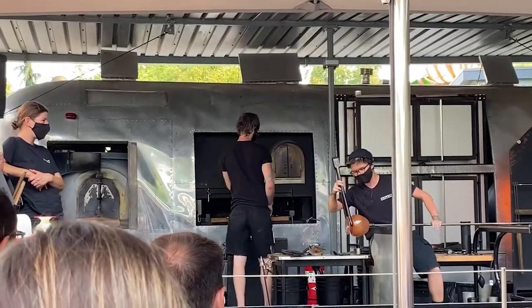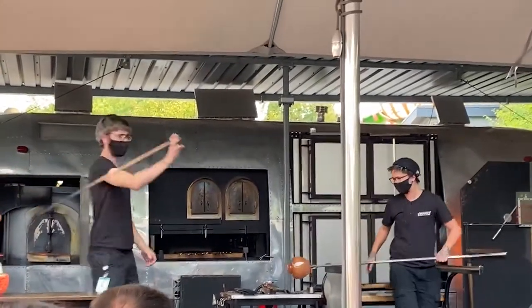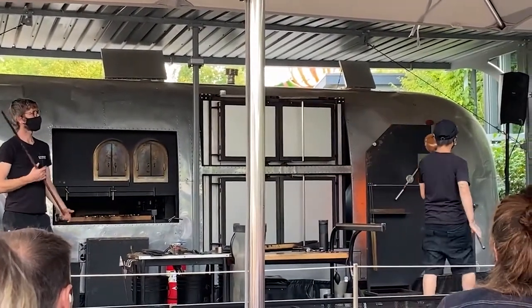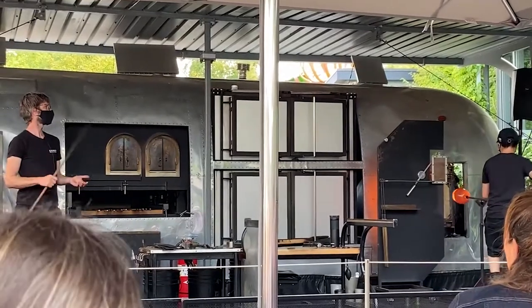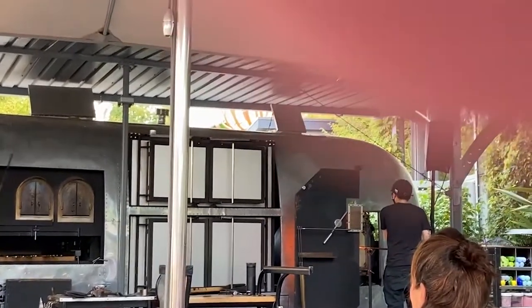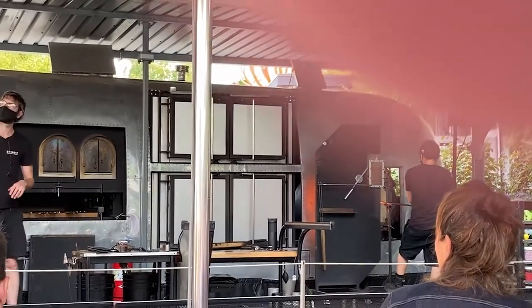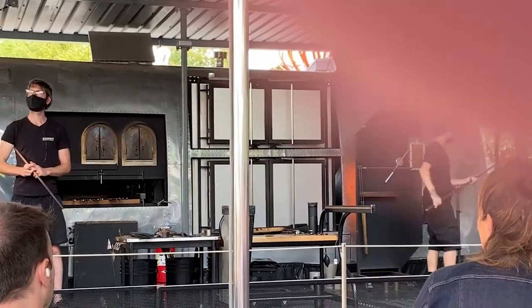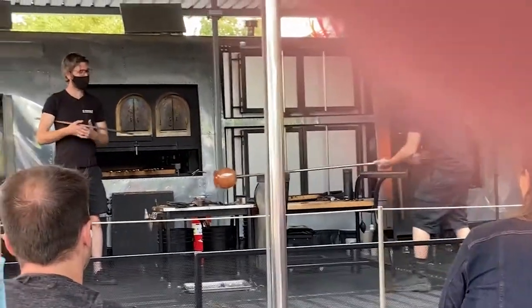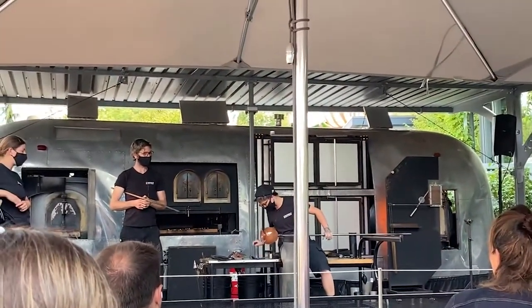What do you think? Do you like it, Alana? They love it. Do you guys love it? So the final destination for this base — it's not quite done yet. It's got to go through a slow cooling cycle called annealing, which happens in our silver box — the top one — that's what we call the annealing oven. It's at 950 degrees Fahrenheit, 510 Celsius, which is a happy resting temperature for the glass. Hot enough the glass will not crack, cold enough it will not change shape. At the end of the day when we're finished working, it's on a program to slowly cool the glass down.